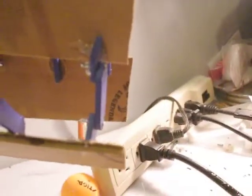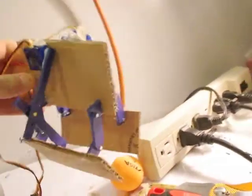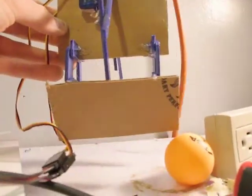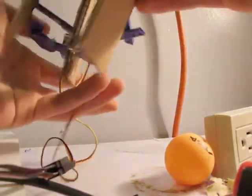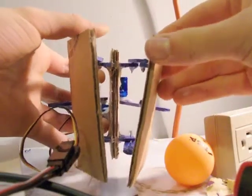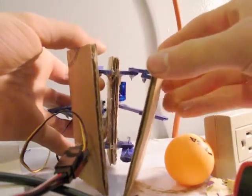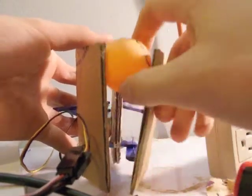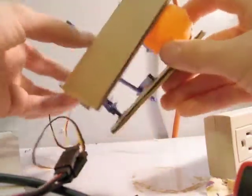I've used just some cardboard and PVC and two servos to test out this idea. All the joints are secured by nail, the same way that I put together the rotary walker pieces, and that will probably be changed later. Another idea I have to refine this design is that right now these beams are not quite parallel, but essentially parallel. In my final design, I will probably tilt them so that when the claw picks up a ball, the ball has a tendency to be squeezed towards the front.